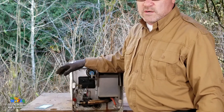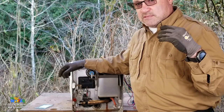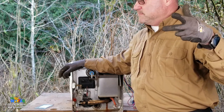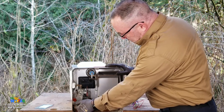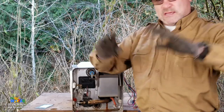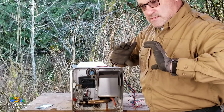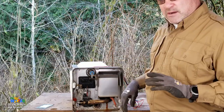And on those water heaters, you have two different size orifices for a 6-gallon or a 10-gallon. So if you have an Atwood Dometic water heater and you need to replace your orifice, note that there are two different part numbers for the two different sizes. Okay? And then the LP gas flows through, it picks up some air down in here, and it goes into the burn chamber and creates ignition. Now, what we're going to do is slice these open in the next little bit, and you're going to see this tube thing that's like a dead-end tunnel where flame goes in and comes back out, okay?